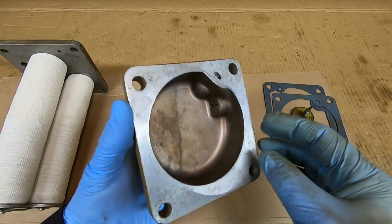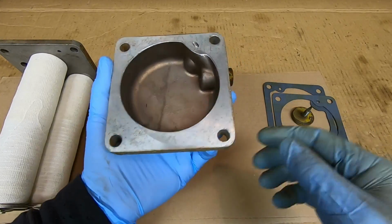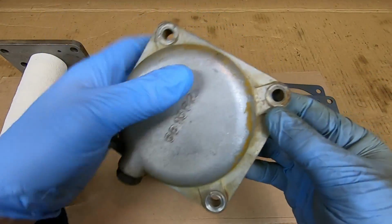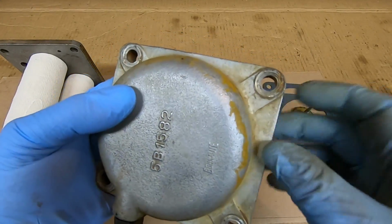These are usually always distorted. Because they're just aluminum, they'll pull down and create low spots around the 4 attachment points there. And these openings, especially at the top, like to distort and close in around the stud, because you have lock washers and everything grabbing onto them.